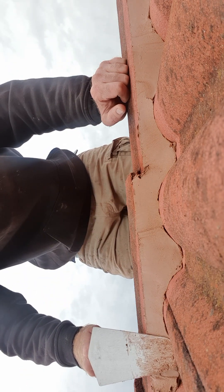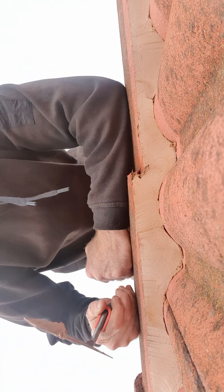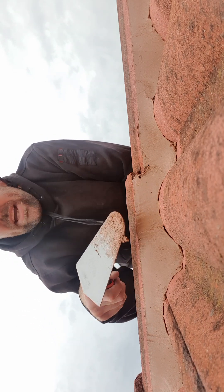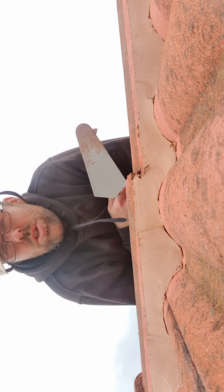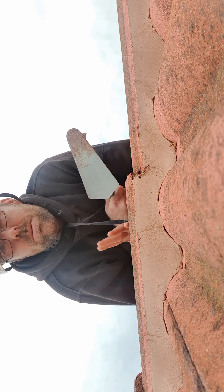The key is just smooth technique and try not to lift the trowel off — probably for about six inches. You want to go over each part maybe three or four times if you've been doing this a long time. As a newbie, you might want to do it six, seven, eight, nine, ten times to make sure it looks as smooth as possible.